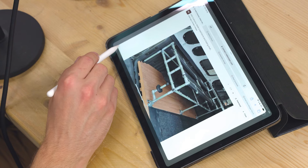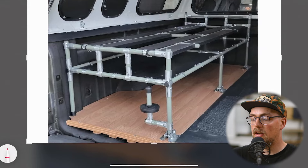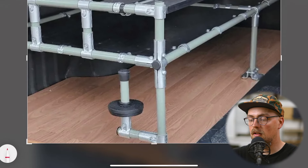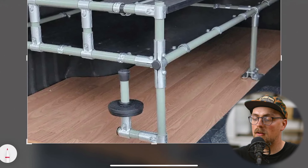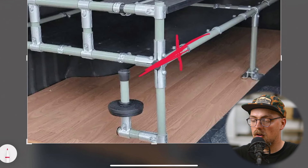Basically, this is not really the way we normally see the 4-Way Connector used, because it's kind of in an orientation on its side. We'll look at more common uses here in a moment. But as you can see, it joins four pieces of conduit together. You have one that runs continuously through it, and basically this could be on any part of this span here, because this middle piece is made to run through the middle of the connector.